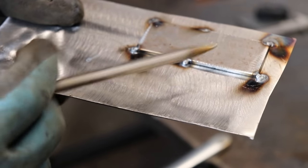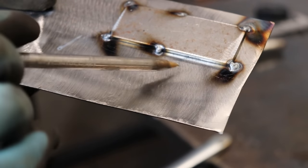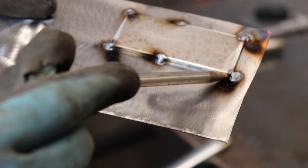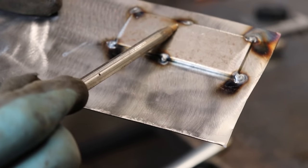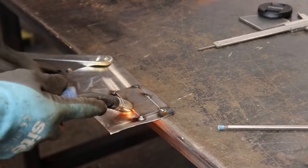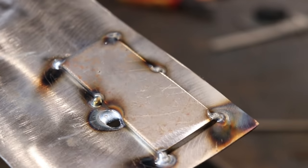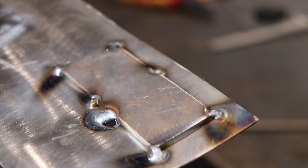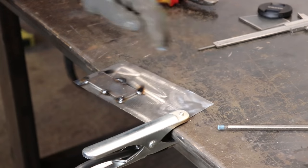There's a little bit of a gap there but it should be all right. So I'm going to do one now across here and aim the wire right into the crack of the join down there, like I would welding two pieces of the same thickness together. So you can see that just blew straight through. I've probably got it set quite hot for this, but I'm going to leave the settings like that and do the other side how I said to do it, and then we're going to check it out.